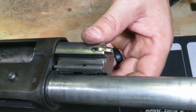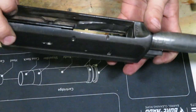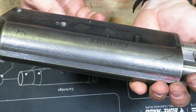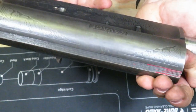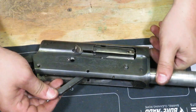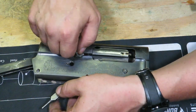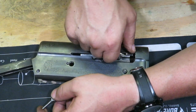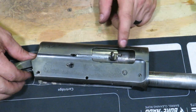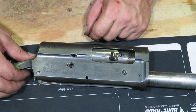To do that, you've got to line this front up — see it's got the grooves on both sides. What I do here, because I need to get this link out right here, is just let gravity do you a favor — let that link fall down as you push it back in, grab the link. Now that's set up like it's supposed to be. You can see now that it's in the shotgun, it moves forward like it's supposed to.